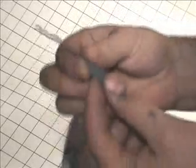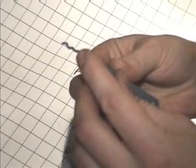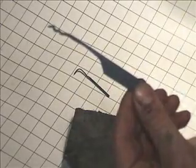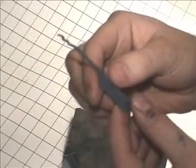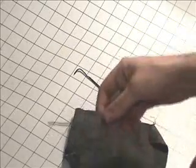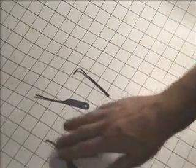Another little word on rakes is that when you make your spacing, you don't want to make your spacing smaller than any one pin can fit into. There is a sensible spacing, and using this blade as scale, it's fairly reasonable to figure out what scale I'm talking about. You may want to vary your rakes sometimes. You might want to make random variations or stick with a known one that you found off the web, but make a few. It doesn't hurt to make a bunch of different variations that you can try. And that's about it. Once you've done all this, you should have yourself a beautiful little pick set.